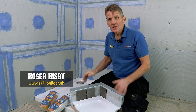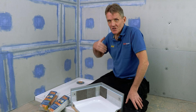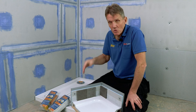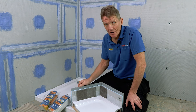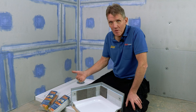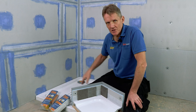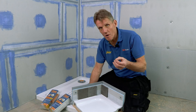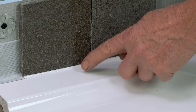In this video I want to talk about the problem of leaks around the back of shower trays and baths. This is something I've come across many many times in my career as a plumber, and it's also said to be the biggest single callback to new housing. It's not the plumbing — it's simply the fact that water is coming down the back and seeping into the structure, because all too often all we're relying on for a waterproof seal is a bit of silicone along the front of the tiles.